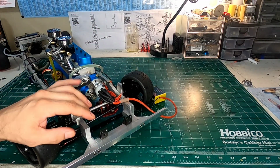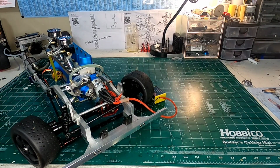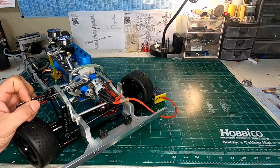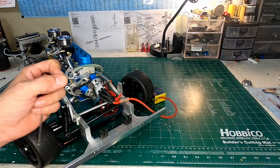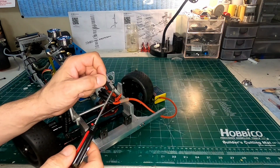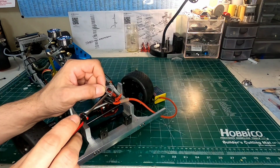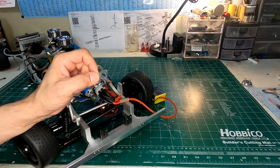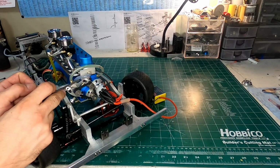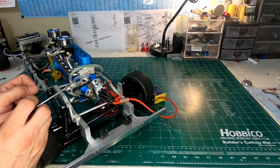Now, in order to make it easier to get the coolant to flow through the pump, what I've done is I've added one of these little spacers. This is an exaggerated size. I didn't make this big of a diameter. I made about half of that diameter. But what this spacer does is create just a little bit more room between the block and the pump. Allows the water to get in behind there a little more easily.